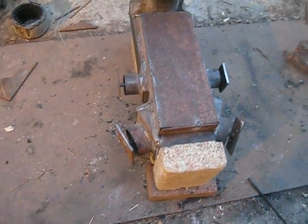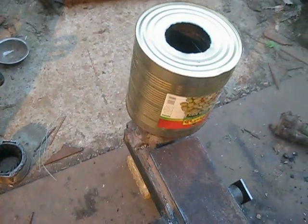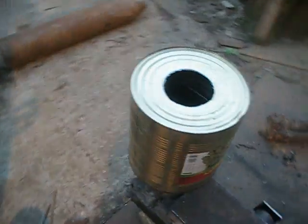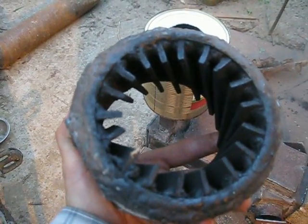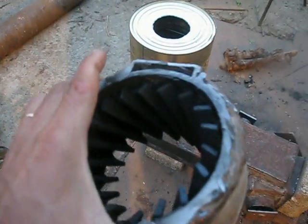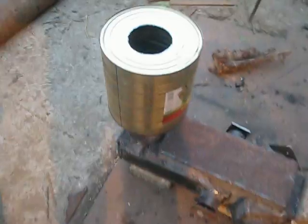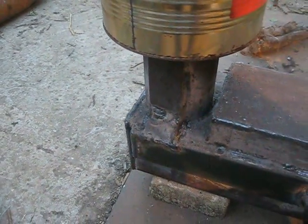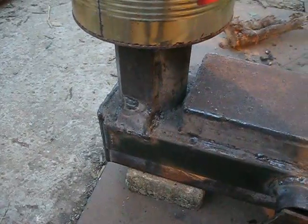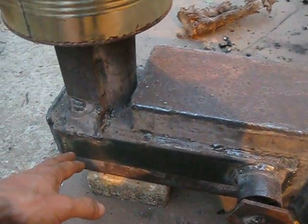I made some changes in the stove. I simply cut here the cap, and remember that there was a sort of edge over there to provide the secondary air. So I tried to improvise here some sort of secondary air channel, because I'd like to see fire here at the edge of the pipe, not down there, for the secondary combustion.